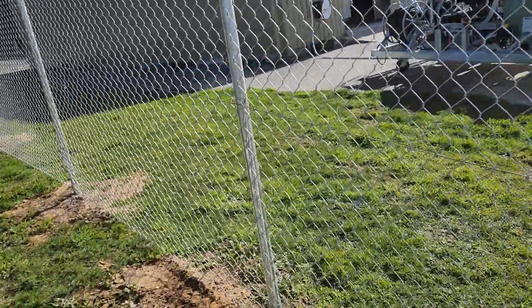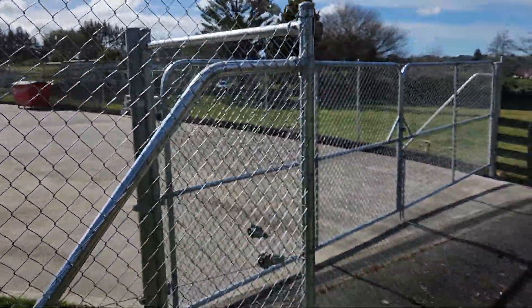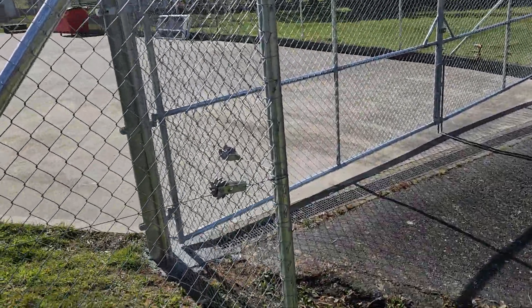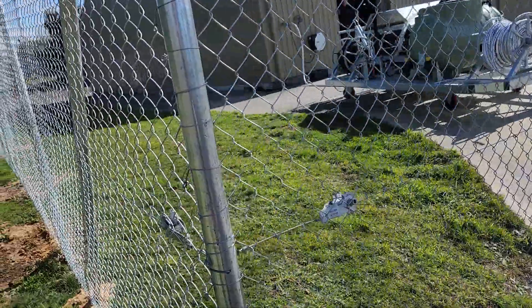The hard thing is just getting it really tight. Getting this wire really, really tight, and one of the things you gotta look out for is when you tighten up these strainers it doesn't pull the post over on a funny angle. So these corners you can sort of set them a little bit on an angle so that when you tighten it up they stay level.